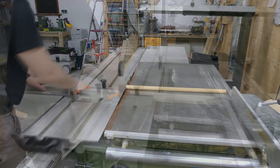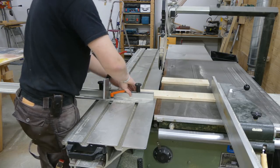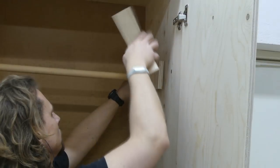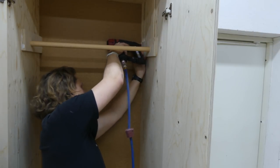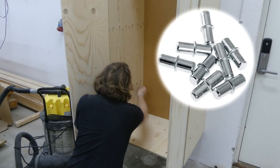To make a clothes rail I cut a piece of 25mm roundstock, which is about an inch, and then some scrap plywood that I drilled a corresponding hole into. I used two more pieces of scraps to get the right distance from the top and attached it with glue and brad nails. These braces would also hold the top shelf. I also attached some 5mm pins that make the lower shelf adjustable.